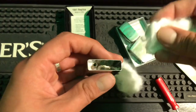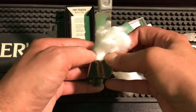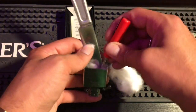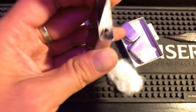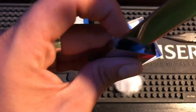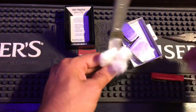We grab the World War II mess knife to repack this World War II replica Zippo. Take the wick, place it on one side nice and tight, grab the first wad we made into strips and push it in evenly — you want to make sure you're doing this evenly on both ends, end to end. Take it out, put your finger on the back to hold the cotton in. Before you stab it in, find the wick and push it up against the cotton so when you're looking in there there's no visible wick — it's all pushed up against the cotton. What we're trying to do is get an even amount of saturation on the wick at all times; it makes for better performance and a longer-lasting wick.